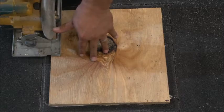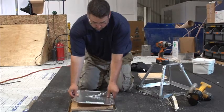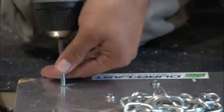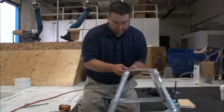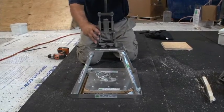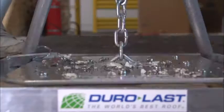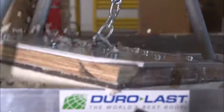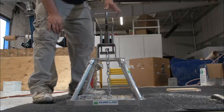Once traced, cut out from the wood base down to the existing roof deck and remove the debris. Next, attach the pull plate to the wood base with 12 No. 14 1-inch long screws. Place the tester frame over the pull plate, along with the pull tester with the pressure reader. Secure the pull plate chain to the pull tester. Operate the pull tester until failure occurs, or the pull tester is maxed out at a thousand pounds. Repeat this process at all test sample locations.